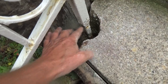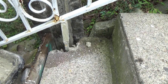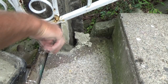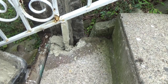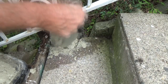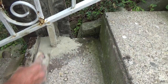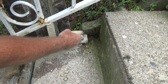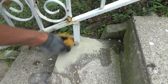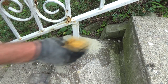Up here I put two little forms and I'm going to fill it with cement. You've got to make sure it's wet, and get it down in there. Make sure it's in there good. Get my concrete edger — you can see the edge here, that's what we want to mimic, best we can. We're faking it. Then just get the sponge. Only six, seven, eight minutes later, took the forms off, forming around with the sponge while it's still wet.